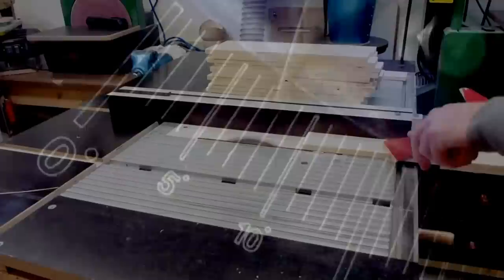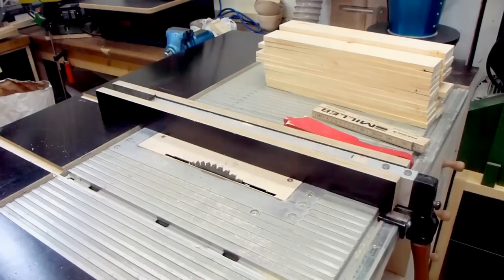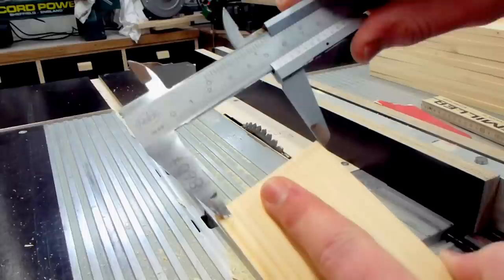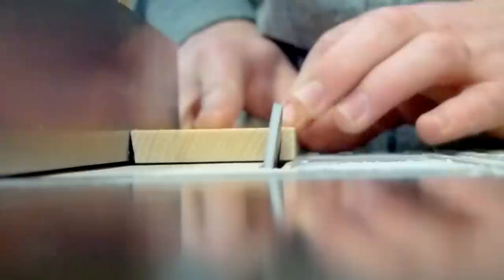I try to set my not-so-great table saw as close as possible to that angle, then simply cut all of the pieces with this bevel on one side. Before cutting the other bevel, it's really critical how far the fence is from the blade, because the width of the strips determines the diameter of the bucket. To set the fence right I made a test cut on scrap, measured the gap, then adjusted and repeated until I had the right distance and cut the other side of all the pieces.